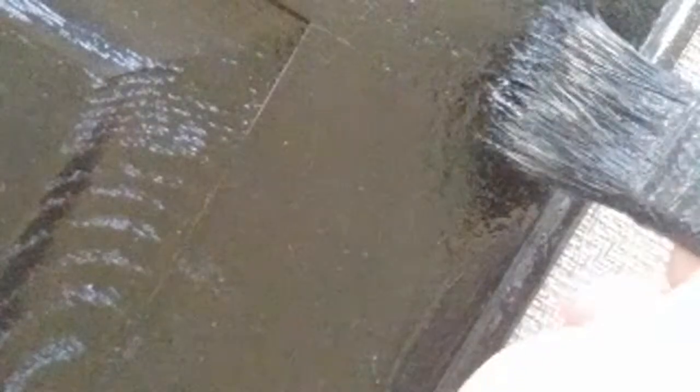Now I probably need just a little bit more just on the tips. I'm going to even rake some of that off just on the tips, as you see. Now, I'm looking across my material, and I can see the little edge that I've tapered, and that's what we want to disappear, that edge. And then we want to blend it and camouflage it in there.